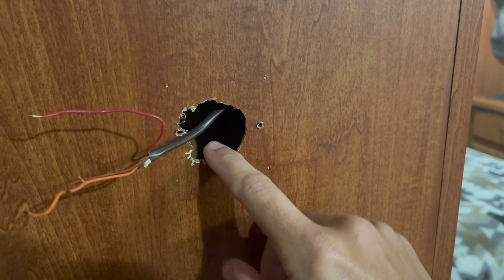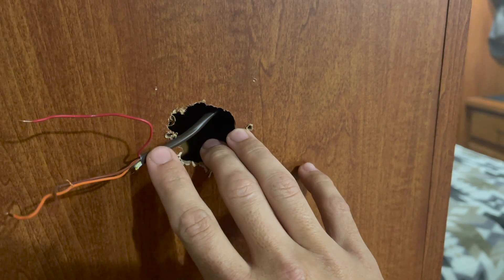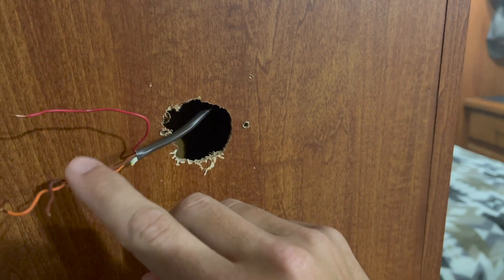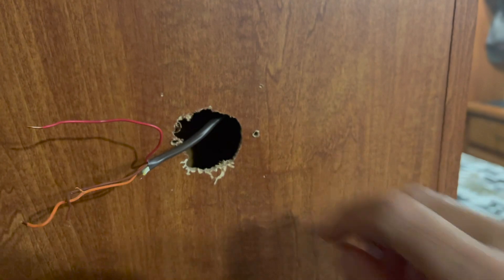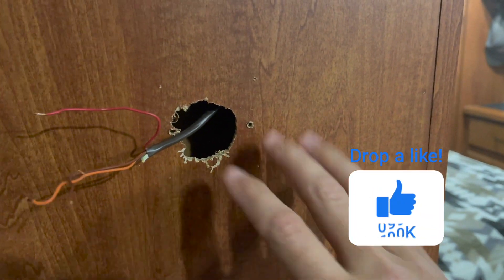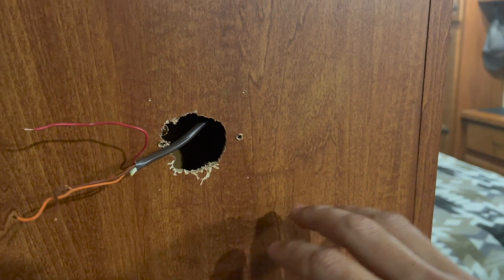Okay, as you can see, I removed the old thermostat. Because I didn't turn off any breakers or disconnect any fuses, I pulled out my positive wire first so I could avoid hitting the other two wires, then pulled the other two wires through. You want to make sure none of the tips touch each other. It's pretty low voltage but you will pop a fuse if you end up touching those together, so just be careful.